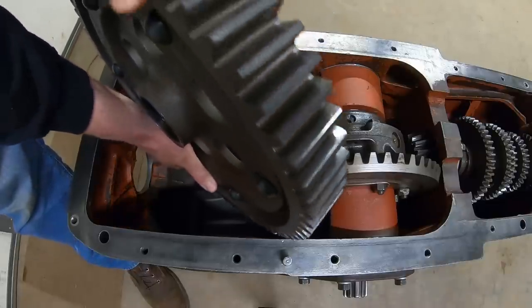That's because back in '16, when I re-bearinged this the first time, furloughed from BNSF, not sure where my next paycheck was coming from, having just dumped $800 into ball bearings for the whole back end, I decided that I didn't want to pay $17.99 a piece for new O-ring seals at the time. So we applied liberal amounts of the old Permatex Ultra Blue and said, send it. We don't have to do that now, but I'll say one thing. The Ultra Blue did its job. They didn't leak.